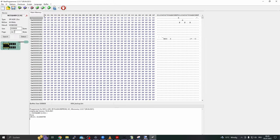So let's plug the adapter in again, because if in trouble, you can always prove this with the multimeter. So, pin 2 of the header and pin 1 of the IC. And we do have continuity. Okay? This is important, because otherwise the flash will get hot and there is a high chance to damage the flash or the programmer or both. So pay attention to the orientation.